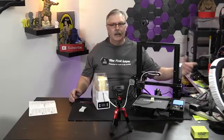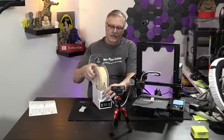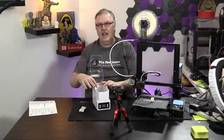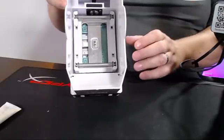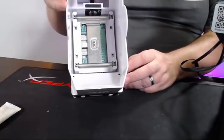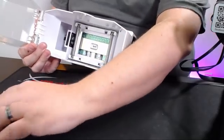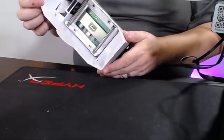We've got some filament loaded into the E-Box, and I'm going to show you how things work with this machine. First, I'm going to pull out the existing filament and just leave it out of sight for a moment. Inside the E-Box there is a heater — if I tilt it up you can see there's a little heating pad down there below the main cradle. The main cradle holds your spool of filament and it's good for one kilogram rolls. There's a space in the back where your desiccant pack goes. Everybody gets a desiccant pack with their filament, and that's going to go right back there, sitting behind the little fan.